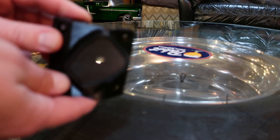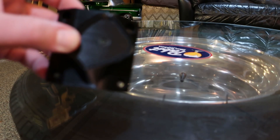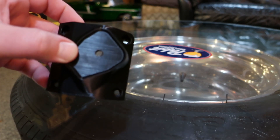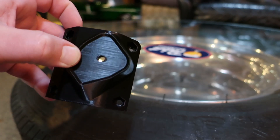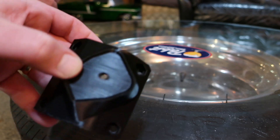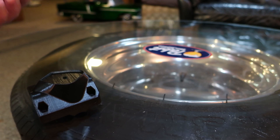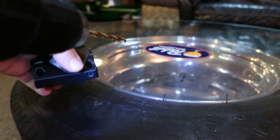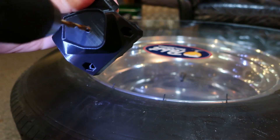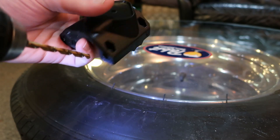So I had some video that I missed getting. When I printed these, I didn't have any of the hardware — no bolts, no tube, I didn't have anything. I just bought a printer and started printing. Due to my over-extruding problems, all my bolt holes were cut, so I took a 13/64 drill bit and reamed all these holes out that the bolts have to go through, just to make assembly easier.